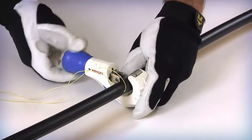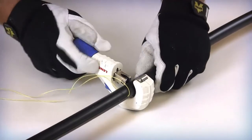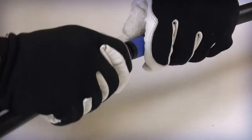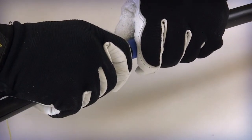Place the cable cutter or tubing cutter around the outer jacket at the original length marking. Carefully rotate the cutter around the cable jacket to score the outer surface. Take care not to cut through the armor layer under the outer jacket. Flex the jacket surface at the ring cut location. This process should separate the armor between the inner and outer jackets.